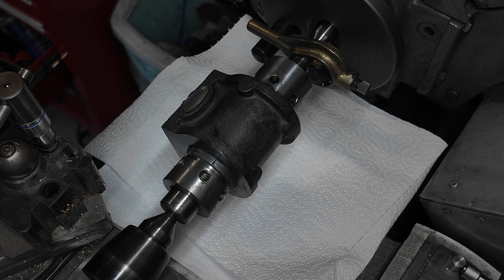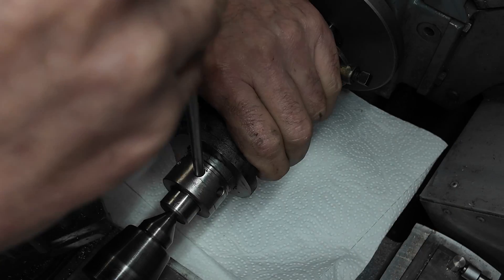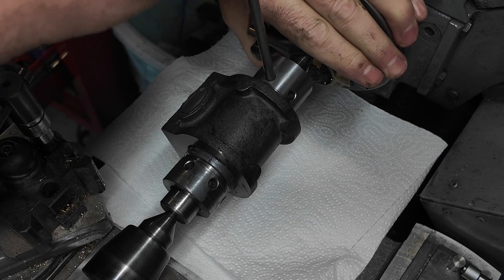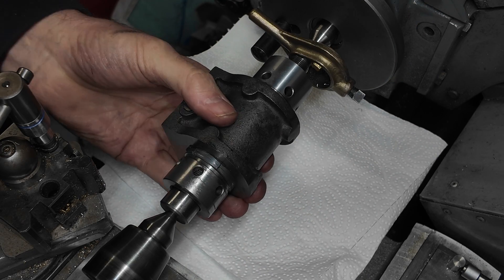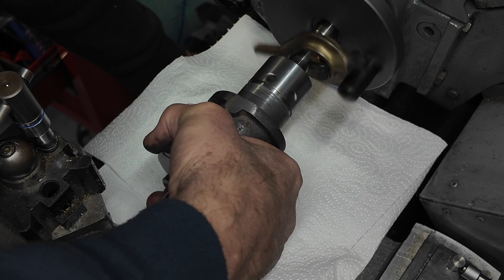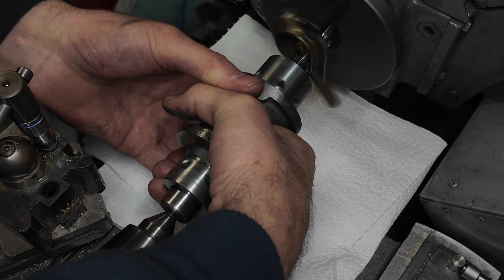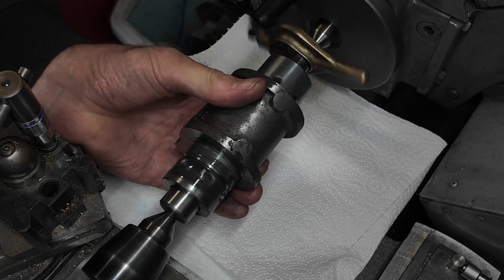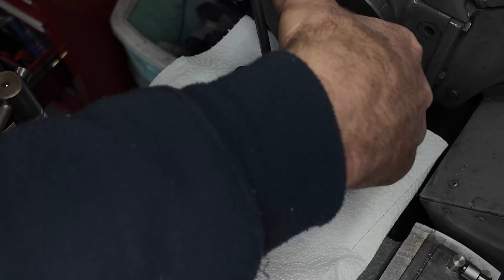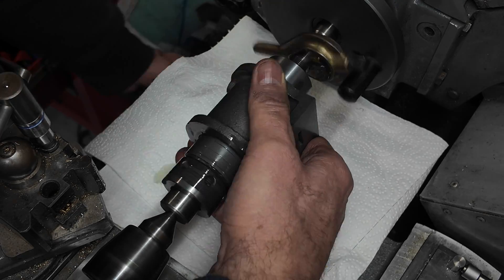Finally it's the moment of truth where we actually use the lap. I use a convenient piece of quarter inch bar to tighten things up so that it's just snug. I've put lots of diamond paste on and now it's just a matter of moving the cylinder around while the lathe slowly turns the mandrel. Notice that I have covered the lathe to protect it from the abrasive. Adding some oil helps. It's necessary to tighten things up from time to time, pushing the lap onto the cone to make it larger.